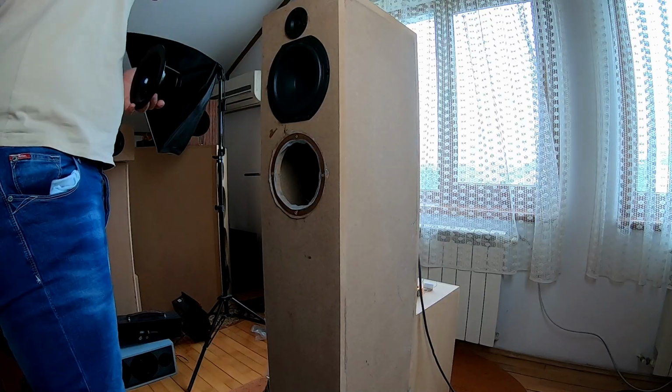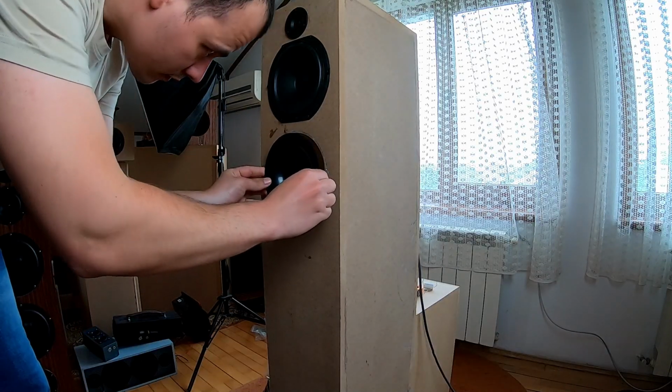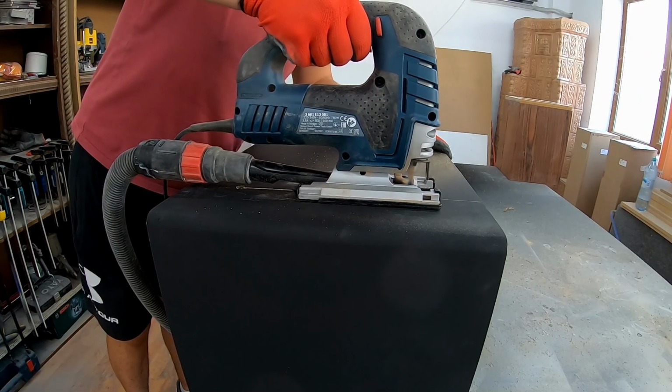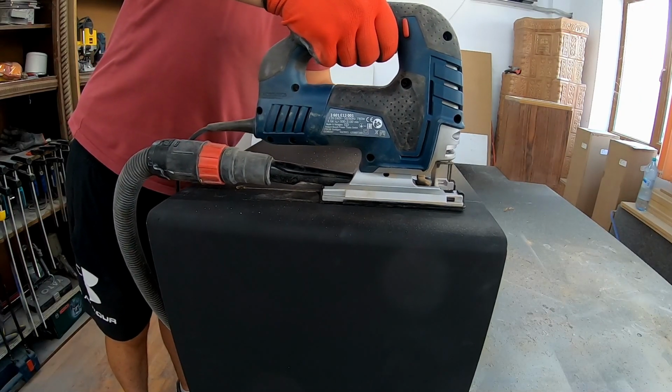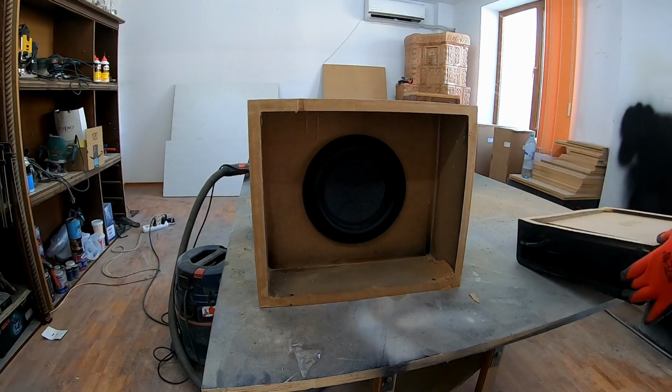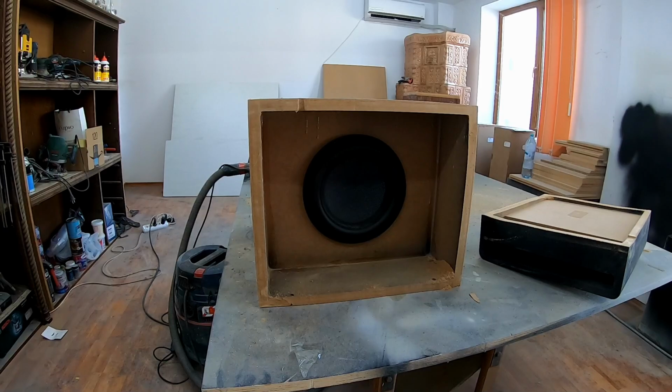Ideally, a circular port should be used, because if the tuning is not right, you can take the port out and adjust the size and then put it back in. In case of a slot port, if it doesn't turn out right, you need to live with it or build another box. The reason I chose the folded port was because the port is too long and doesn't fit inside the box. Brian pointed out that I should check out how Bose does it.